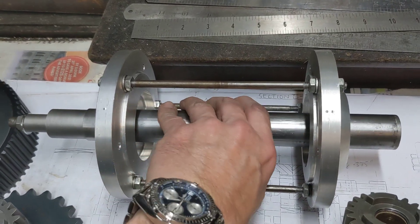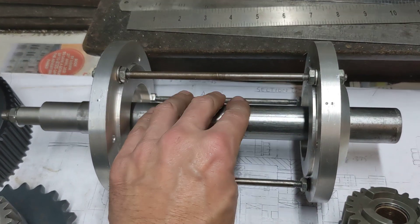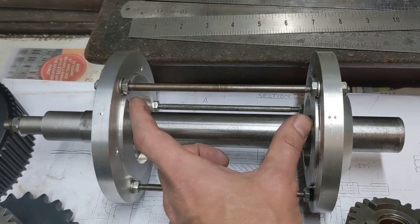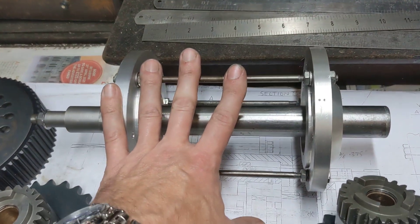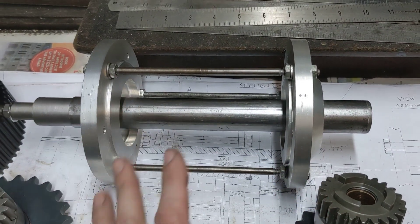When we've got the final shaft created, finished, and put through, we'll be able to fit the parts onto the spline and then fit the selectors onto those, measure the clearances, and then mark out and drill those holes. So that's one of the last operations, but that's how we intend to do it — and the nice bonus is that we can then demonstrate the box in operation when it's all together.